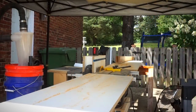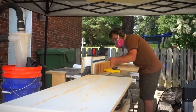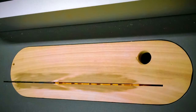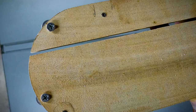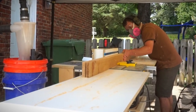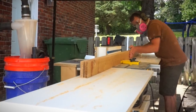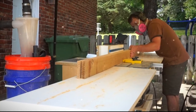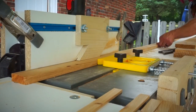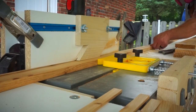You can see here the reason I got the table saw in the first place — I needed to rip a ton of strips. That led to a few things I wanted to add: first, a zero clearance insert; secondly, because the strips are so skinny, I needed a fence that sat very close to the face of the table; and thirdly, infeed and outfeed tables, because these were extremely long strips and this helped make more stable cuts.